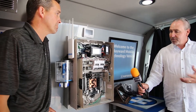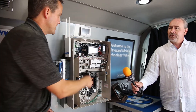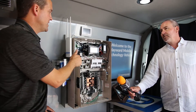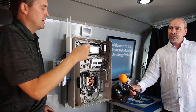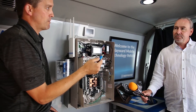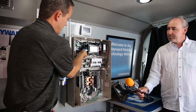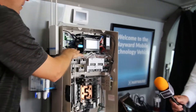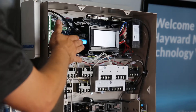I've heard it's really just like a computer — it's firmware. Yes, exactly. You're never going to have old software on your OmniLogic. At any time you can take a thumb drive, go to a desktop or laptop, look on the Hayward website, go to support under OmniLogic, and download the freshest software. You take that thumb drive, plug it in here, go into configure and do the software update.